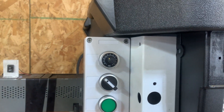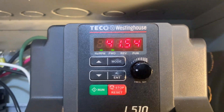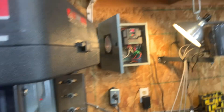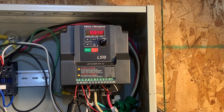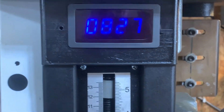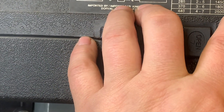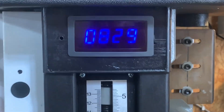Let's turn on the mill. I've already got my trim pots at a certain speed. The VFD indicates everything in hertz — we've got 41.5 hertz. If I increase it to 60 hertz — we're at 60 hertz essentially, going 830 RPMs. The belt is set up at position 1 and 6 which is supposed to be 770 RPM. We don't know which one is truly accurate but it sits in the ballpark.